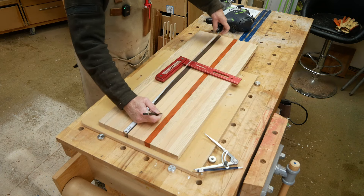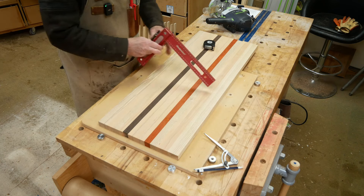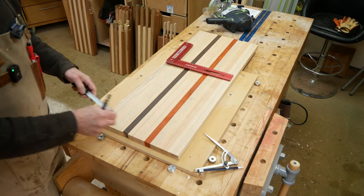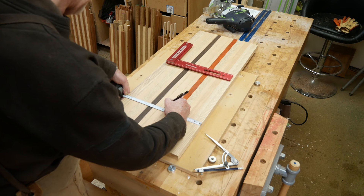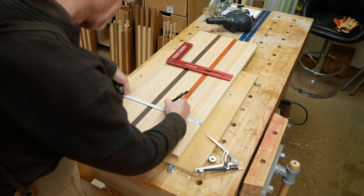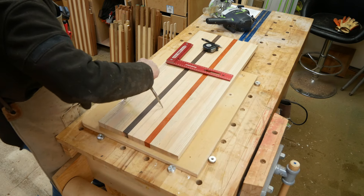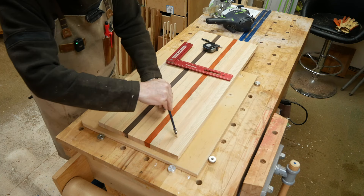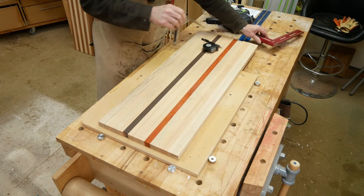The whole board is way oversized — it's at 800mm. So I'm going to cut 170, square that across, bring that down again. 160 is right on the edge, so I'm going to go 162, 163. That's the centre point I want — my 160 mark. Well inside. Perfect, more than happy with that.